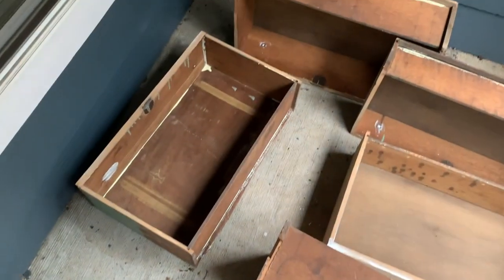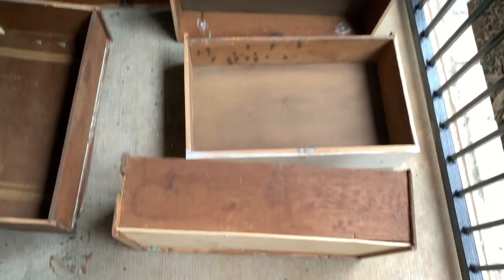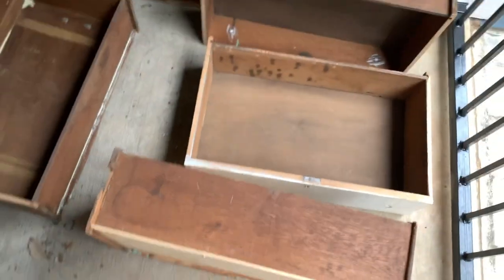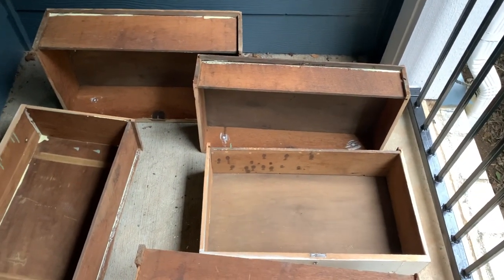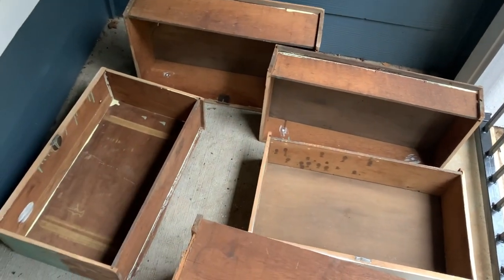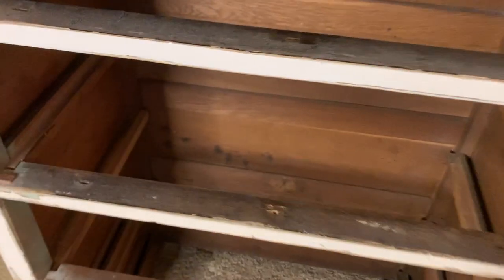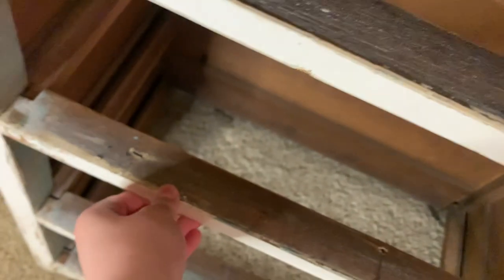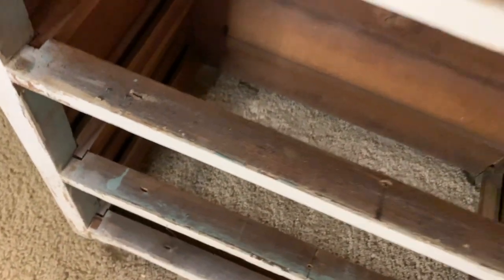Phase one is complete - you can see all the glue drying. I'm obviously going to have to sand it down later. This one drawer was so hard I had to use nails and stuff to get it in there, but they're much more secure than before. Once those are done, the next step is to start painting after we sand it down - I'll probably wipe it down again too. I'm also going to make sure all these pieces on the dresser frame are secure before I start spray painting in there as well.